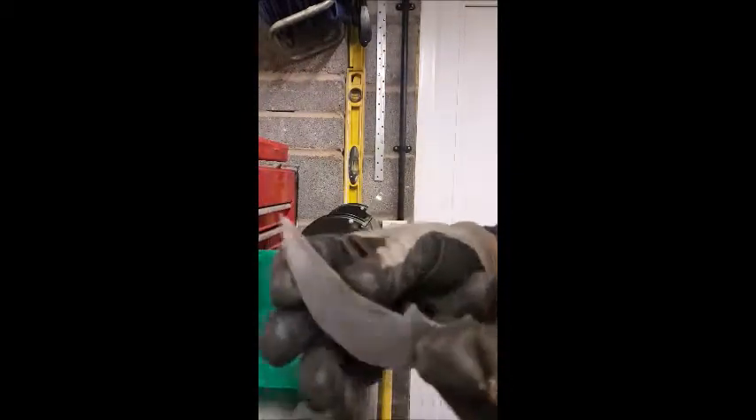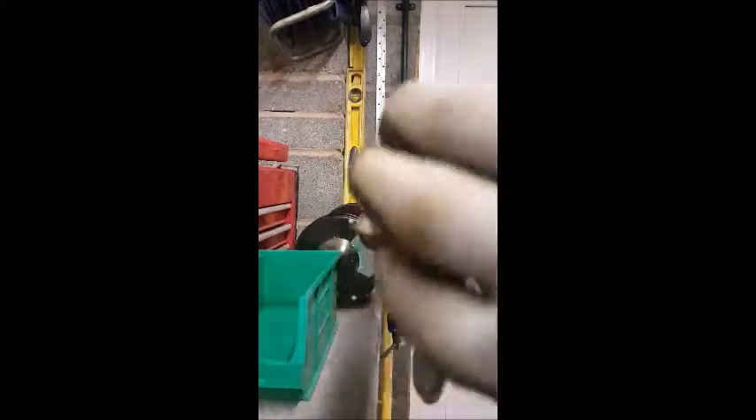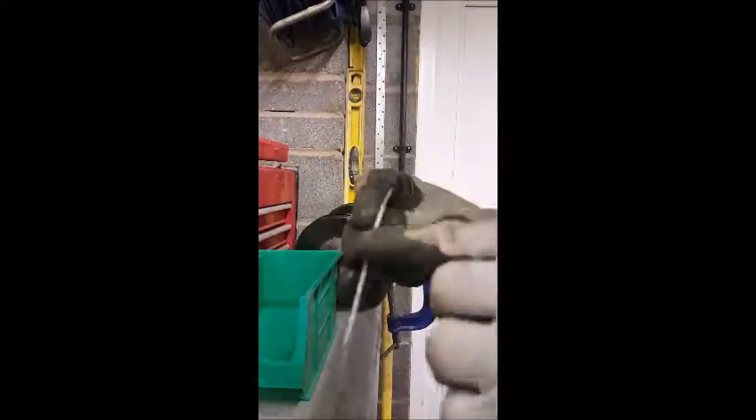As you can see now, it's starting to create a nice bevel, so that's looking quite nice at the moment. It's not going to be a particularly harsh bevel because it's a karambit — if it was too sharp it would snap if you put any kind of force onto it. So I'm leaving it quite thick; there's going to be a lot of meat left on the blade — a nice two and a half millimetre thickness there.